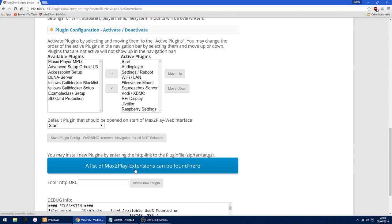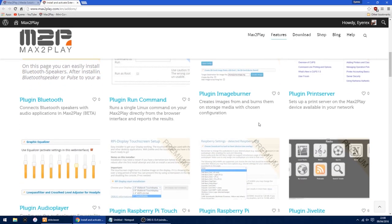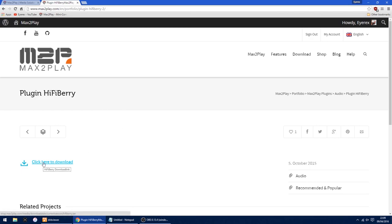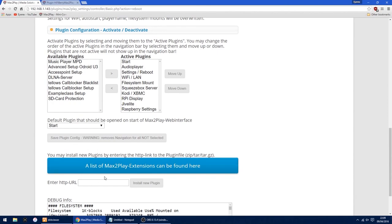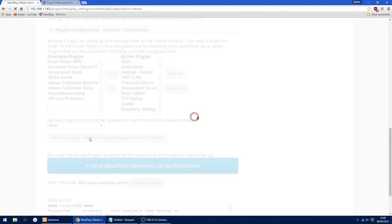So the thing you do, you come down here, this big blue box, click on there, and these are the available plugins you can install. It's quite a few. If I scroll down a little bit further, you will find the HiFiBerry. There it is, the plugin HiFiBerry. So if I click on the center there, and then on the left here, click here to download. It gives you a web address. Just copy it and click OK. Now go back to the main page, and underneath the button you just clicked, you'll enter the URL. So if I just paste in there and then click install new plugin,